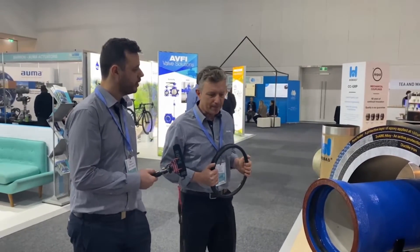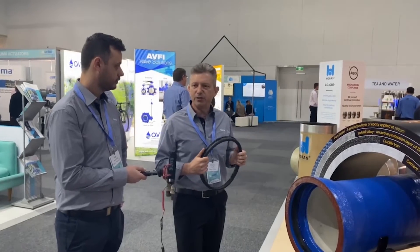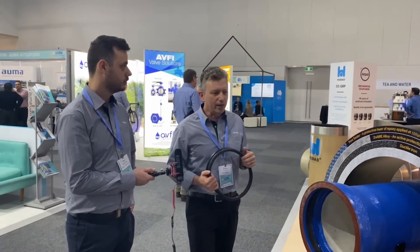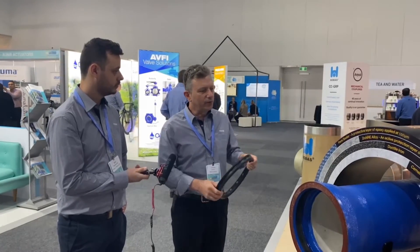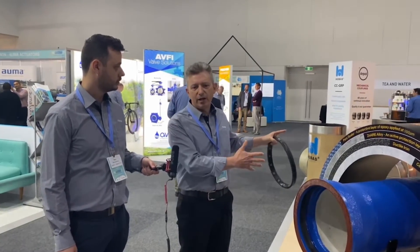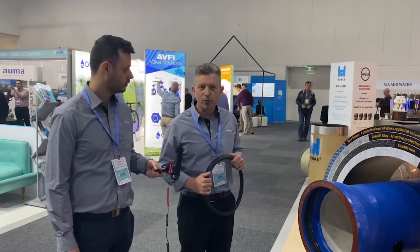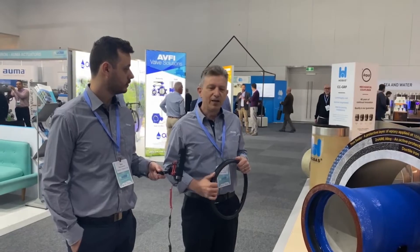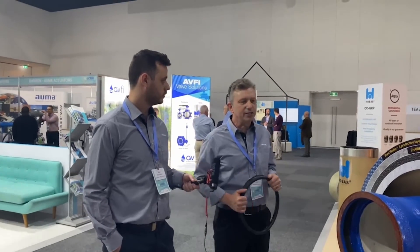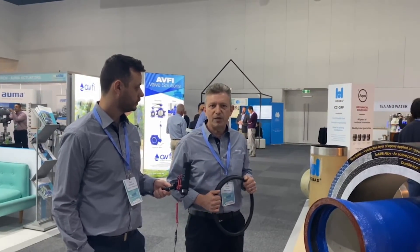I know we offer something called Century Plus — can you tell me a little bit more about that? Absolutely. Part of our offer is that we're absolutely a service company — we don't just bring in products and sell them. Part of the offer is our soil testing, as well as Century Plus, which is our handling and installation training for the complete system: the valves, the fittings, and the pipe. It covers everything from bringing pipes to site, how to prepare the site, how to unload pipes safely, putting them together, and getting them in the ground. It also covers the quality management system for achieving that installation, and quite often contractors are asked by water authorities to provide evidence of a quality management system for installation of pipeline systems. This is a quality installation management system we can hand over to contractors to enable them to pick up work and tenders.